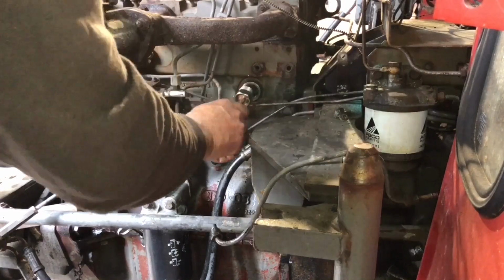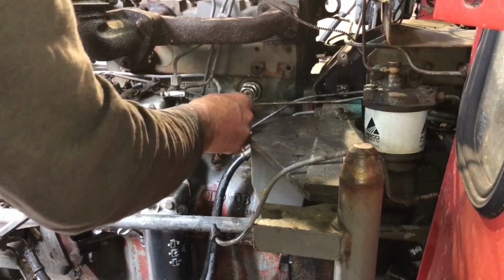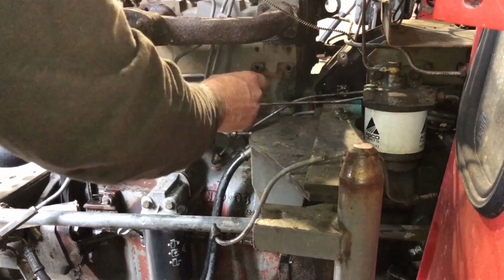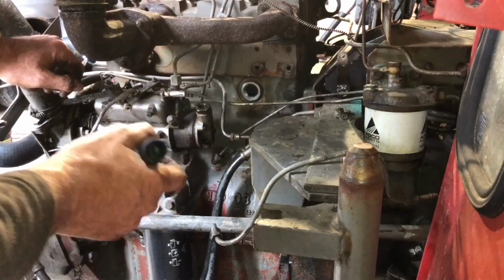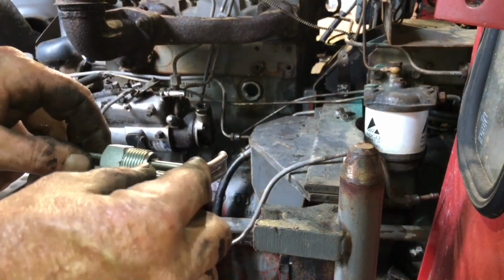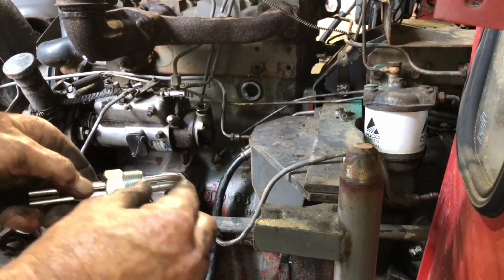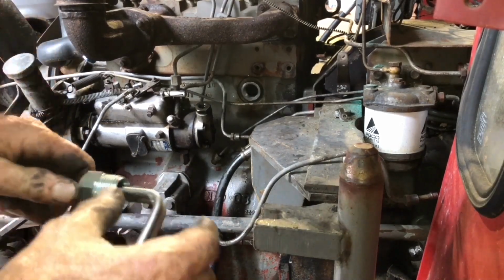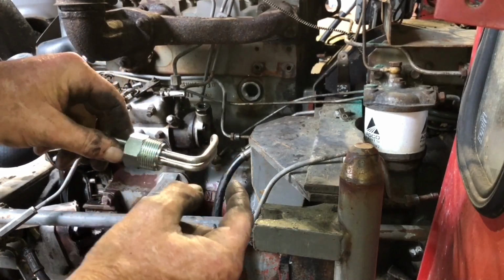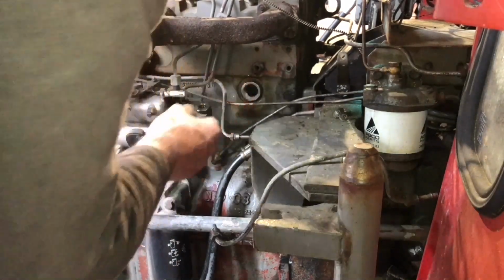So it's another one of those generic things, like this is the right thing, and actually it's not. Because the bend is not right. And you can't alter the bend because you won't get it in there. And you can't put it in there when it's already done up. Obviously. Well, that's left me in an interesting predicament. So if this was any shorter, you couldn't get it in, and once it's in, this is now hitting the back of the block inside, so you can't do this up, and this is not movable. And even if it was movable, and this is on the back of the block, and you try and over-pressurise that, well, there's three things that can happen. You bend this and destroy this, you crack the block inside, or you pull this core straight back out of the engine.